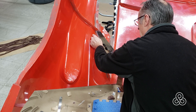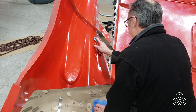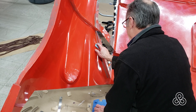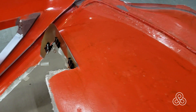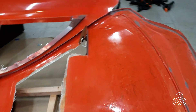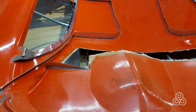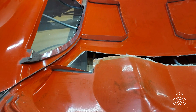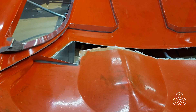Anyway, got to cover the whole car with those. Instead of you watching all that, I'm just going to show you some of the things I've added to these molds to make things a little easier once the parts come out. These small pieces of flashing on the dashboard, one on each side, are just to give me a flange that will drop down and have attachments for an aluminum framework that runs under the dash, holding the door hinges, steering column, things like that.